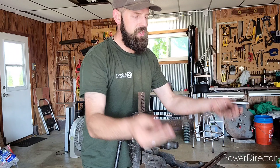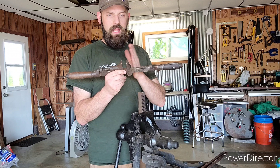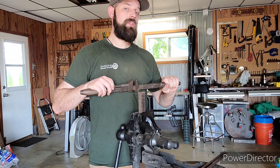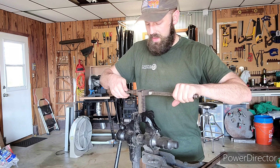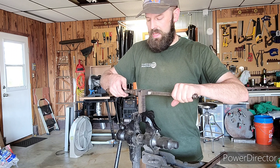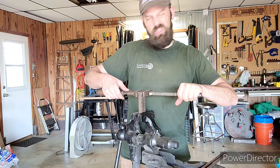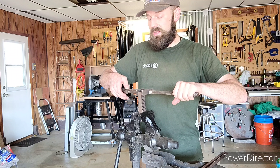For the actual twisting, I have this twisting wrench that I built myself. This is just two old pipe wrenches — I cut the head off of one and the adjustable part, then welded the handle onto the head of the other one. Now I can adjust this according to the different size material I have and twist virtually anything. I'll open it up so I have a nice tight fit on my part. You don't want a super tight fit — getting it in and out will be tough — but you also don't want a lot of slack. If there's slack it turns a little bit before it bites, and remember when the steel is hot those edges are just going to roll right over. So make sure you have a fairly decent fit.